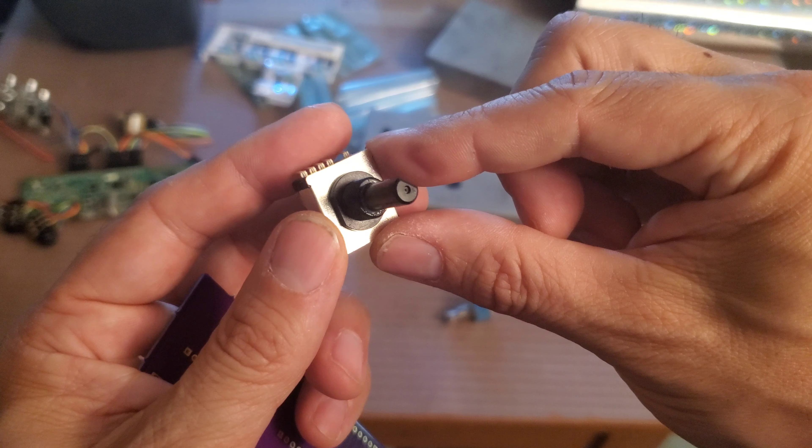Just before my recent business trip took me to Mexico City. Now, be patient with me — this is an error I made when doing the CNC, it went through and cut a hole there, and these were from some other experiments. But the point is you can see there are nine holes across and one big one here. What I want to do to populate this is put eight pots in there, and in the middle I'm going to have a selector switch. One reason I put eight pots on there is because in my experience designing new pedals you need a lot more knobs than your average guitar pedal.